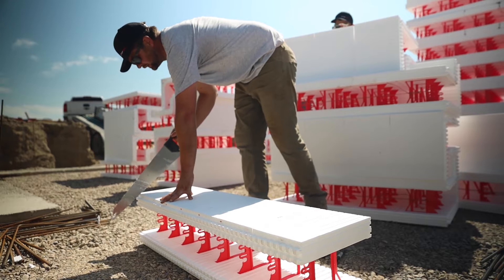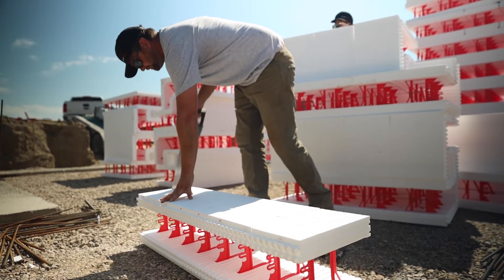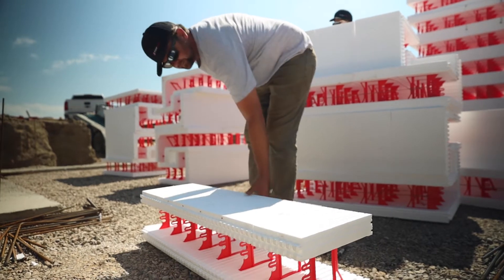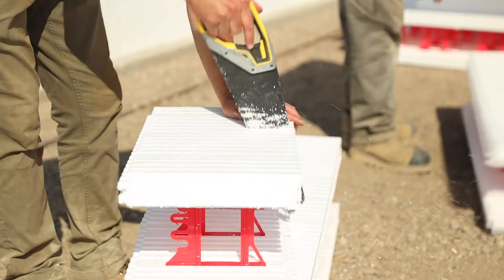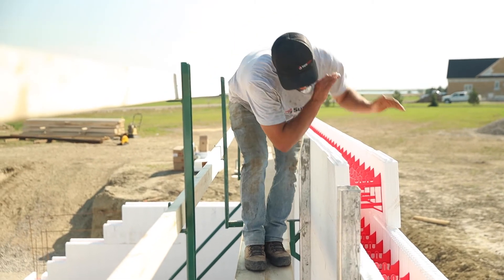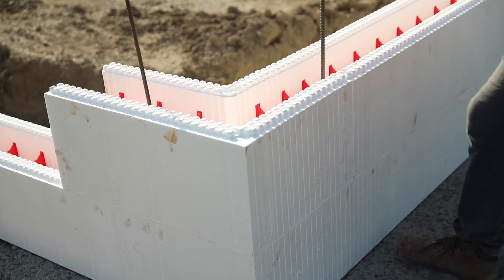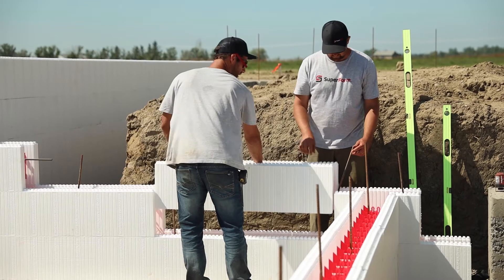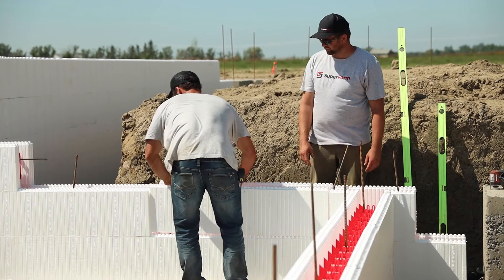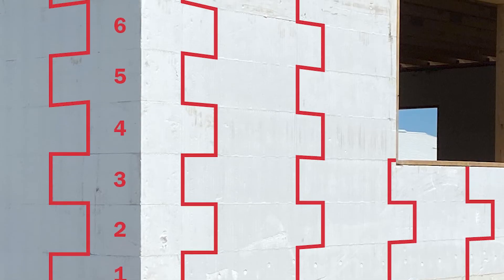It's not efficient to cut through a tie, so skip to the next cut line and take one inch off the opposite side of the block if this happens. When cutting blocks, save any pieces that are bigger than 6 inches for use elsewhere in the wall. Likely, every wall length in the house will have one filler block. Ties may not line up in this area. The first and second row determine the layout for the rest of the courses — every other course should line up.